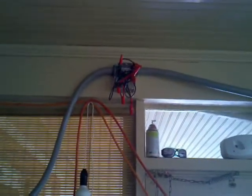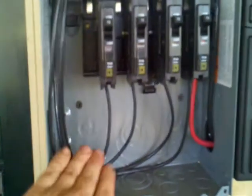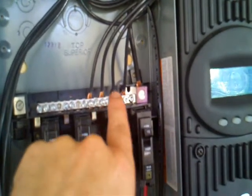Okay, after several hours of wiring, I've got them all tied in. I've got to jam them in that box, or I might have to get an extension for the box, and then put a couple straps on that conduit. I've got all the negatives tied into the neutral bar, all the positives tied in, and I've got it set up as 1, 2, 3, 4 and 1, 2, 3, 4, with 15 amp breakers in there now.